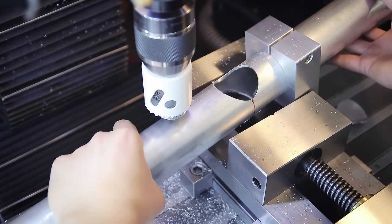The reason for the vent holes: if you weld any hollow structure like this frame, as you're heating up the material there will be expanding gases inside the frame that have to escape somewhere. This doesn't really become a problem until the point where you finish the last weld and seal the hollow structure — in that last moment the only way for the expanding gas to escape is into your weld puddle, which is guaranteed to mess up the weld and create all kinds of problems. By drilling these holes we're giving the gas an escape route so it can move from one tube to the next until it finally escapes out of one of the open ends of the frame. Now everything is prepared — I've triple-checked every angle and made sure everything is parallel and symmetrical — so I can start placing tack welds.